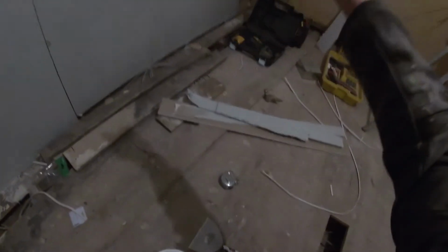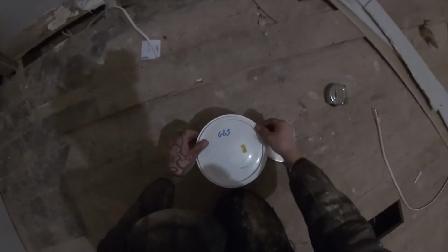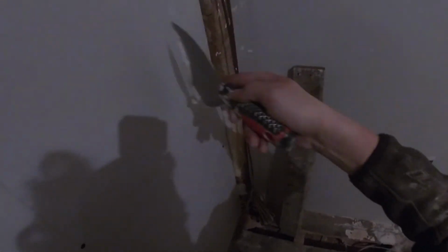That's gonna be a separate video. We already made the tests on different surfaces, even on bare brick. What it does, it's gonna just stay flat once the adhesive dries out. Magic. Okay, 6-inch knife, and let's fill in. Leave a bit more. You're gonna sand it down, because even when they say it doesn't contract, it does. They all do.